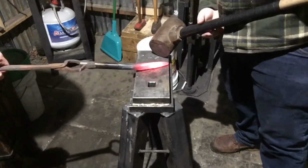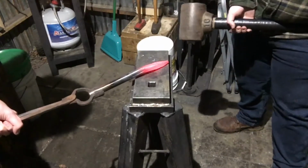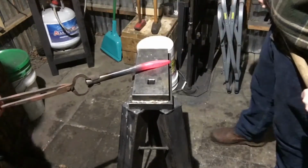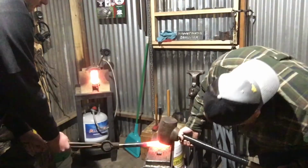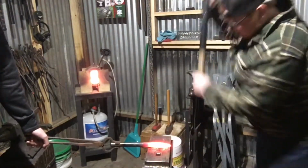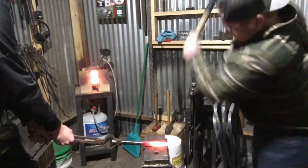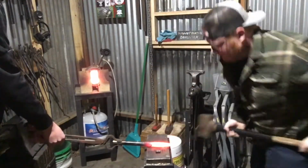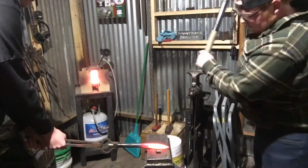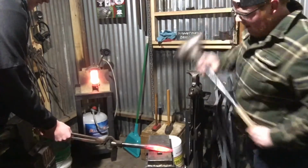Flip it so this bend is coming up. 180 in. There you go. Like that. Flip flat on the anvil. Now turn it. There you go. Lay it flat on the anvil like that. Yeah, readjust. Back it up. Rotate your tongs. There you go. On your back. I know. I'm trying to freaking watch. Stay there.